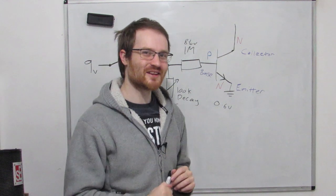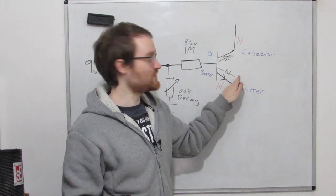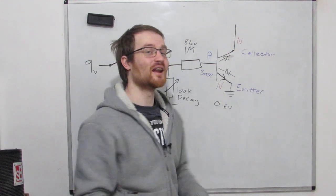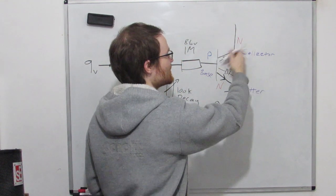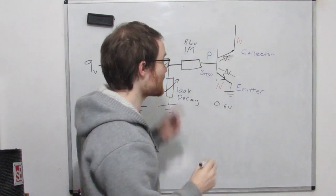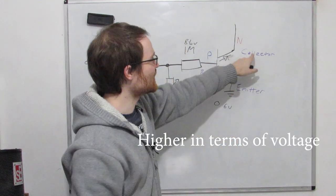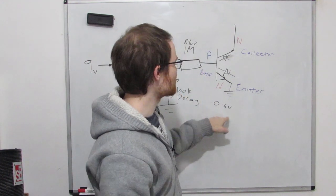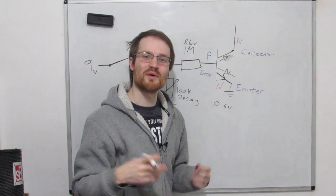Well, there's one little thing that we need to bear in mind. Like we've got a diode here, we've also kind of got another diode here. You can see there's a P to an N and there's a P to an N. Don't worry if you don't understand at the moment. Essentially what we need to remember is we need to keep this diode reverse biased. So basically the base needs to be higher than the emitter and the collector needs to be higher than the base. We've got 0.6 volts at the base, so we need to make sure the collector stays higher than that. So let's try and keep the collector above about a volt.